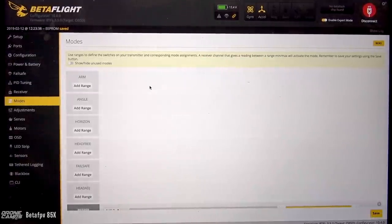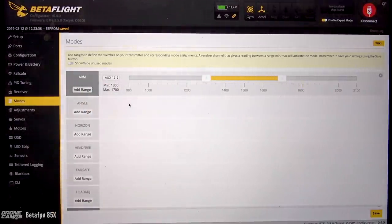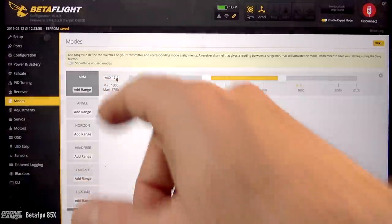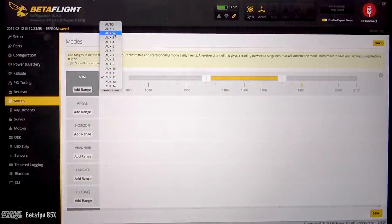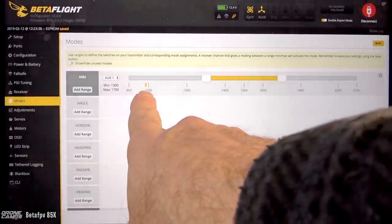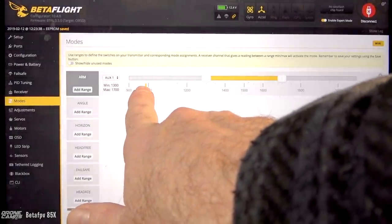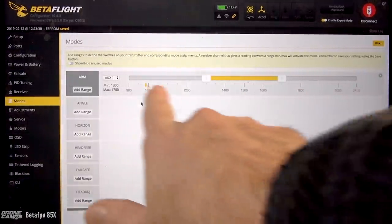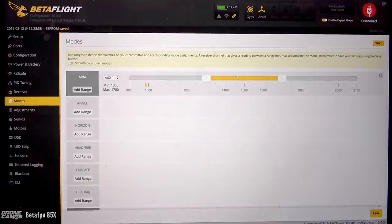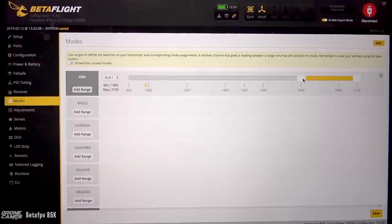And to get your quad to arm, you need to add a range right there. Once you do that, see it kind of automatically selected aux 12 there, but we're going to go back. Remember, we're on aux 1 for my switch, and you see this little yellow dot went back to there because my switch is all the way to the outside position, and that's that position there on this line. Now go ahead and grab your mouse and grab this in the center and drag it all the way out to the edge to the right. Sort of bring this white tab over a little bit, make it a little cleaner, and then we'll hit save